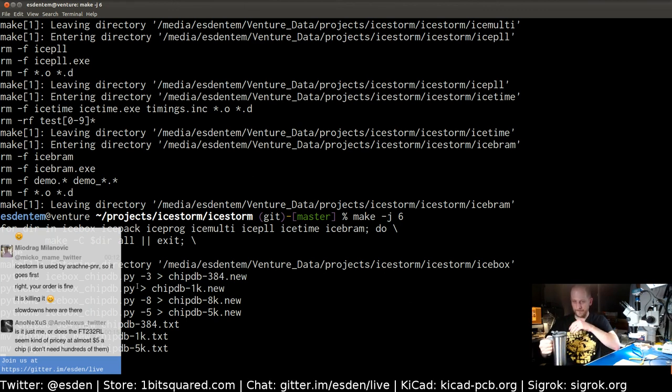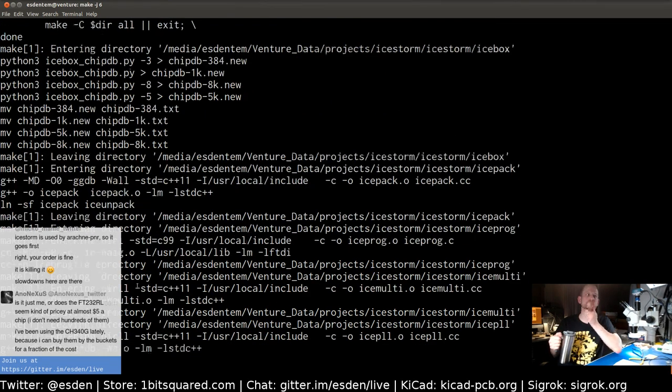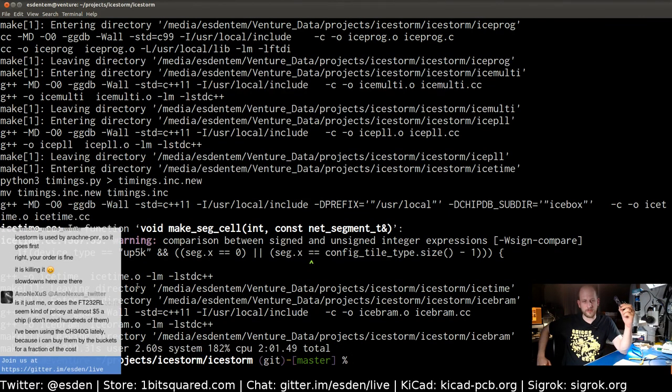Ah, drippy drip. But the water is good. Yeah, the problem with the CH chips, as far as I remember, or anything other than FTDI, is they don't have as much flexible protocol support. In this case, you need a chip that can support SPI as a protocol, or at least bitbang SPI. If you can't do that reliably, it's no good.